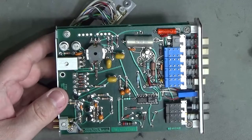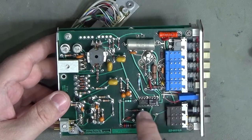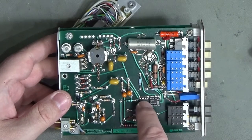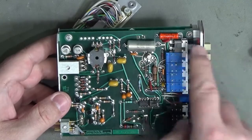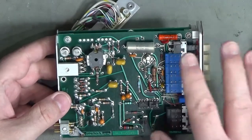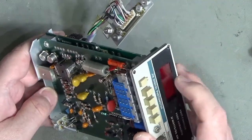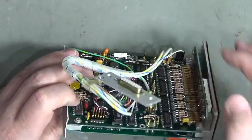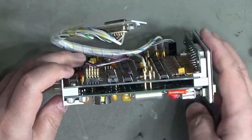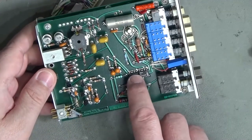What's all this circuit back here doing? These are 741 op-amps, so they'll be running at plus-minus 12 or 15 volts to get sufficient dynamic range out of the device. This has quite a lot of dynamic range - times one right up to times a thousand - and it's got to come in from the probe, so we need a fair bit of amplification and reasonable supply voltages on these ICs.